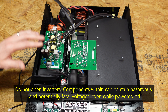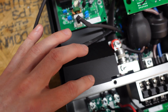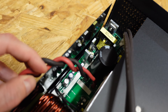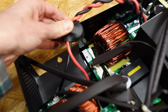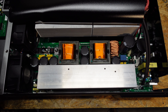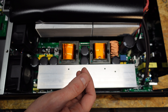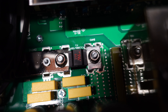I don't want to take this apart too much, but I do want to show you what's here. You can see where the positive and negative leads come in — there's a large inductor, and this baffling is done so the fan specifically cools the MPPT underneath. We have two large inductors at the back as well. The negative and positive come off the charge controller and go into the battery inverter area via a pair of number 10 gauge wire with 105°C insulation. On the inverter side, our negative goes to what appears to be a heat sink, and our positive goes straight through a 200 amp fuse. We have a series of capacitors and some transformers. Here's a closer look at that fuse — it is replaceable and has a UL listed component stamp on it.